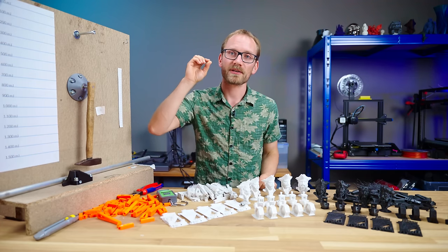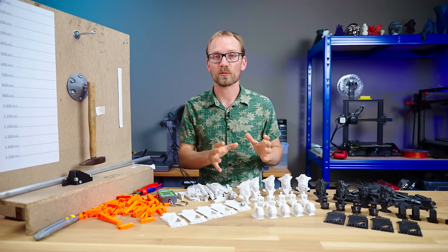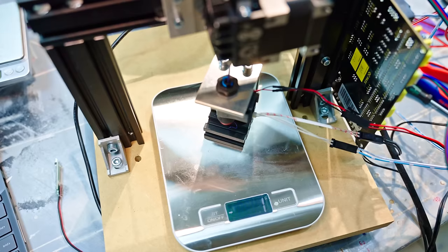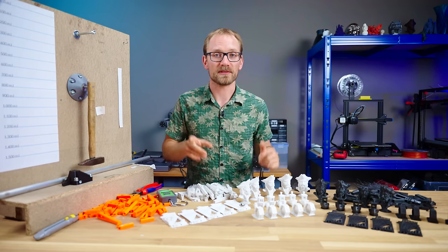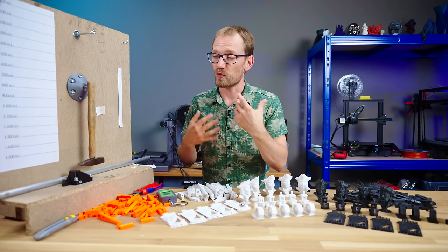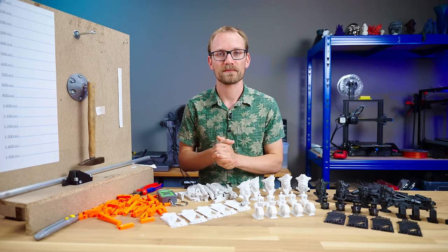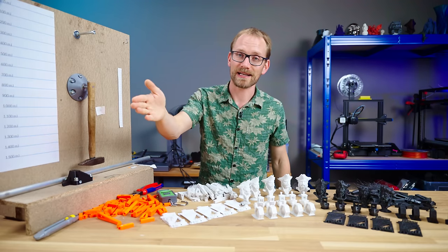So, what did we learn? Well, there's a reason why we landed on the temperatures we now usually print at — they give you the strongest parts without degrading overall print quality. And 'print hotter gets stronger parts'? Not really true, unless maybe you've got a hotend that just isn't particularly good at getting heat into the filament. I've done testing on the Revo and it's actually a bit better at heat transfer than the V6, but it's by no means a super high-flow hotend. Also, the temperatures I'm finding here aren't necessarily the same for all printers across all brands. High-quality thermistors and mainboards will usually have relatively tight tolerances, but it's not uncommon to see an offset of plus or minus 10 degrees Celsius between two cheaper machines. In either case, I hope you learned something — keep on making, and I'll see you in the next one.